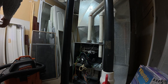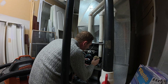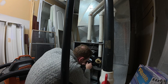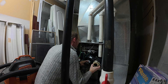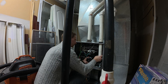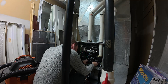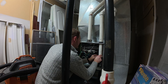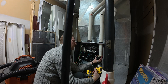After doing this, the furnace has been working perfectly fine for a day and a half. I hadn't gone a day and a half without issues over the last three days — every five hours or so it would trip the pressure switch because there was so much water in there it couldn't evaporate. So the first step was sucking out all the water and seeing if the problem comes back. So far, a day and a half in, we're good. I'll do some follow-ups in the comments as we progress, but I suspect we'll be fine for the rest of the winter — at least until another really wet weather pattern or big temperature change.